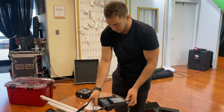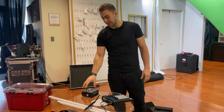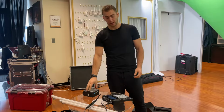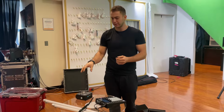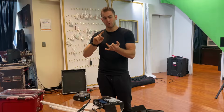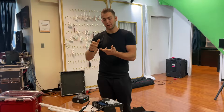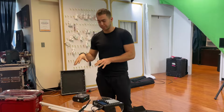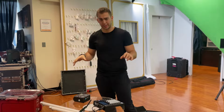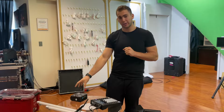All right, so we did a little testing earlier and found out the exact channels of these guys in order. It is, I believe, eight channels, and the order is dimmer, red, green, blue, white, amber, UV, and then strobe. Okay, it was kind of hard to figure that out with the lack of manuals and things like that, so that is the order of this guy. It's eight channels, we confirmed.